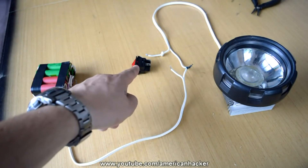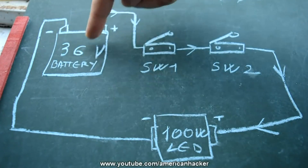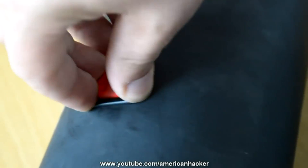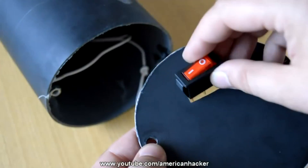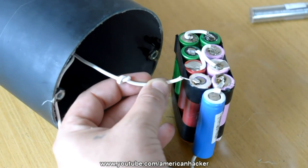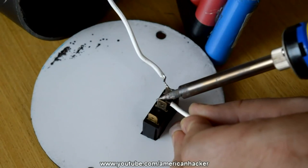Or you can use two 18-volt drill batteries connected in series. The circuit is simple: the LED chip works on 36 volts, so nine lipo batteries make 36 volts. From the batteries, power goes to the switch, then to the LED chip. For safety reasons I added two power switches — one on the back and one on the front. Solder all the wires like on the circuit diagram — I will put a link in the description.